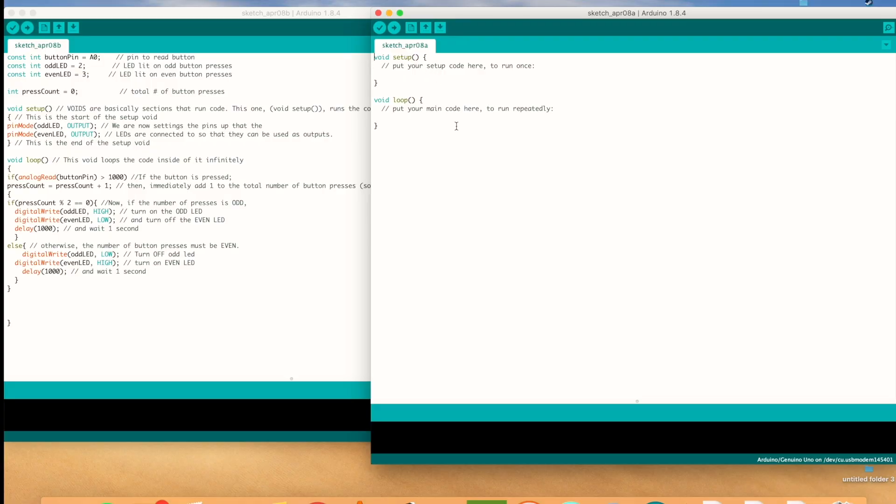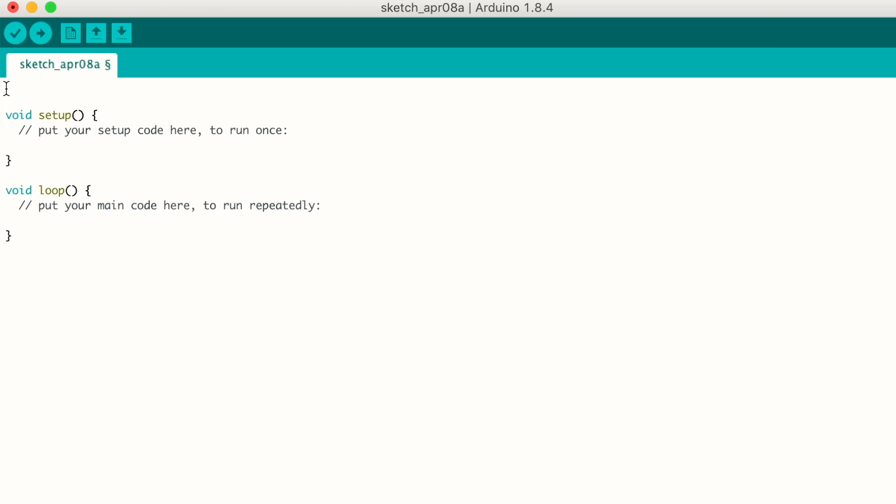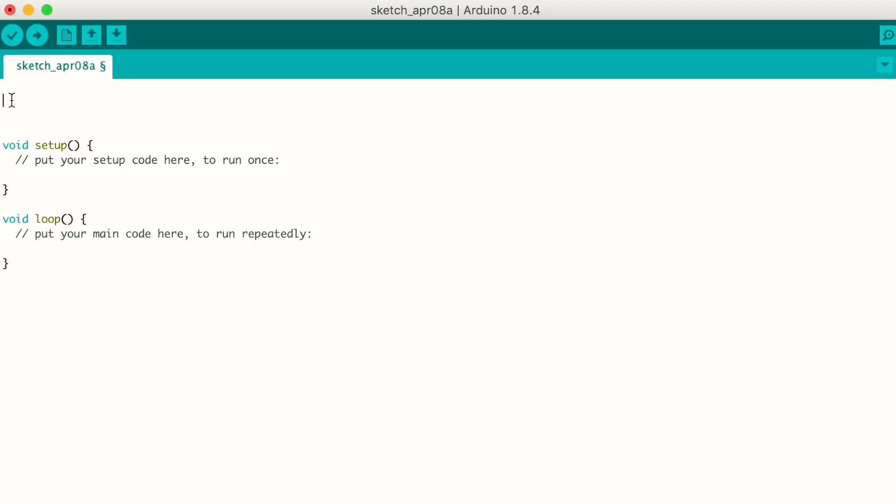Before we start coding, I want to say that I am not an expert coder by any means — I know enough to get by. I'm going to teach you what I know in this tutorial, but there are definitely much better resources out there to learn Arduino code from and I'll link those in the description. Basically when you open up a new sketch you're going to be presented with a void setup and a void loop. These two voids are places where you can put code to be run either once in the setup void or infinitely in the loop void. We're going to use both of these, but even before those voids I'm going to define some variables.